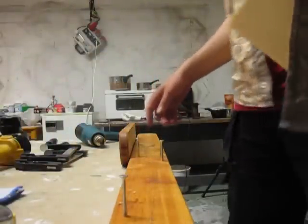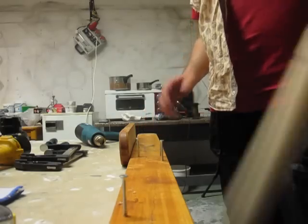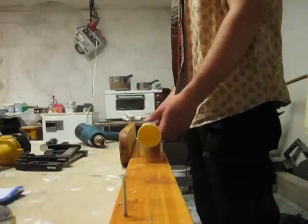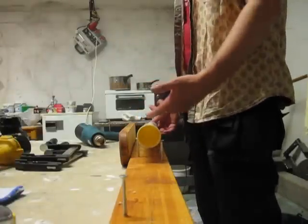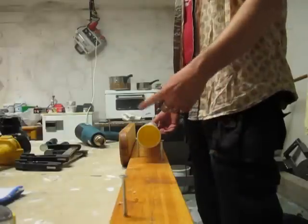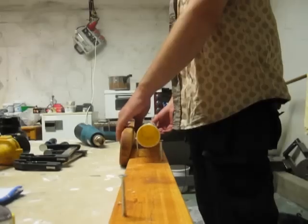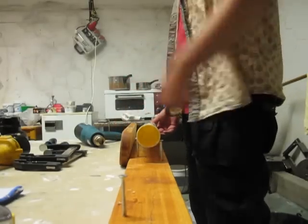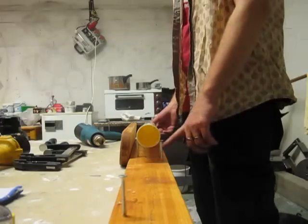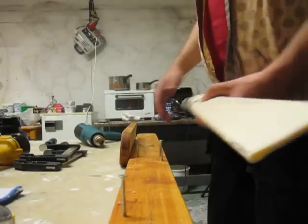A lot of these videos show that there's people putting like aluminum foil here and making a sort of a pocket for the PVC, so that the heat reflects inside. But I think that that's sort of pointless. I think that the thing here is to construct something that insulates the heat so that it doesn't fade away, and wood does the insulation as well as any other material. So wood below and wood on the side, and the air just keeps circulating.